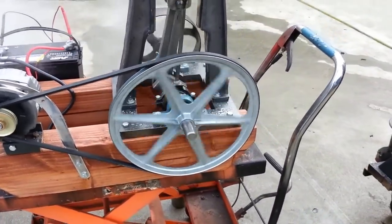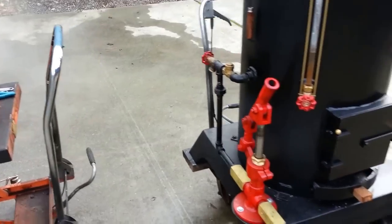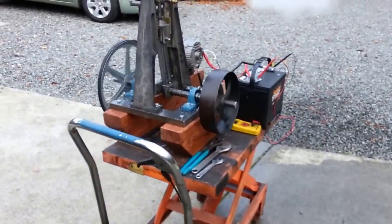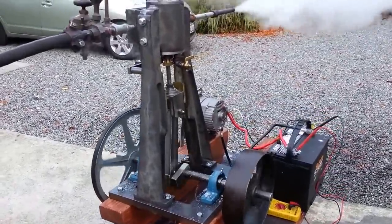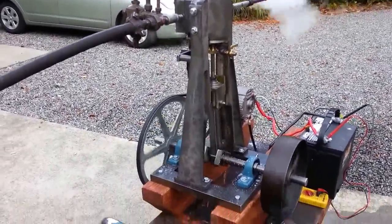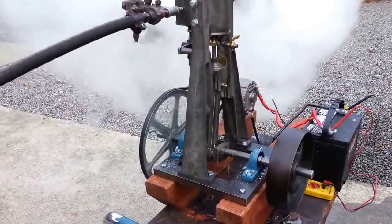That's not really fast enough to charge — you've got to have more RPM than that to start charging. That alternator's got to be running at about 800–900 RPM, maybe 1000 RPM, but the engine only needs to turn at about 250 RPM.